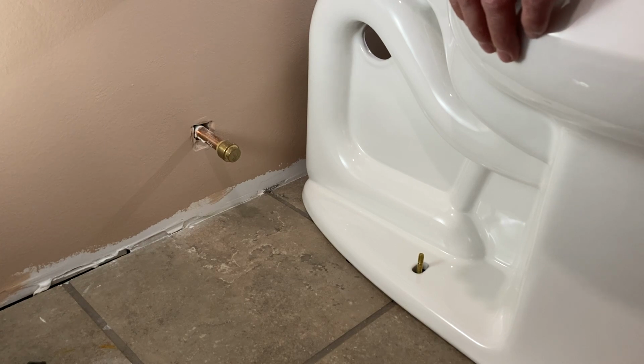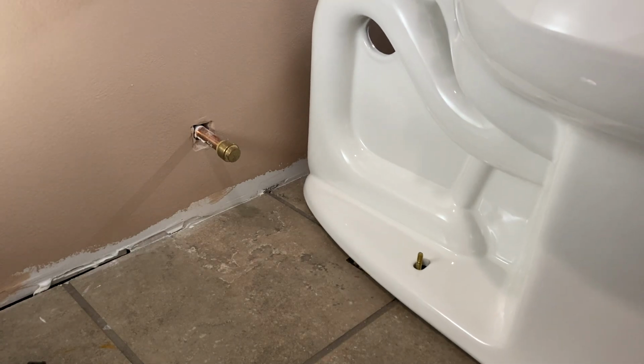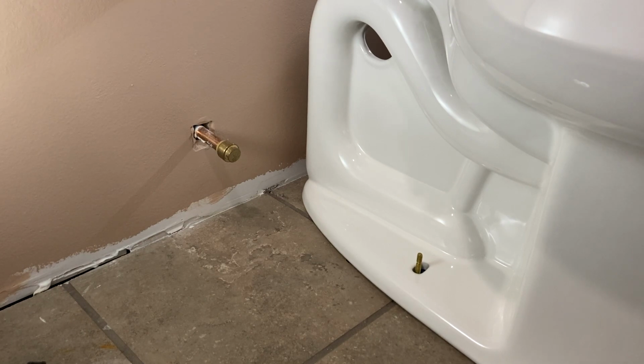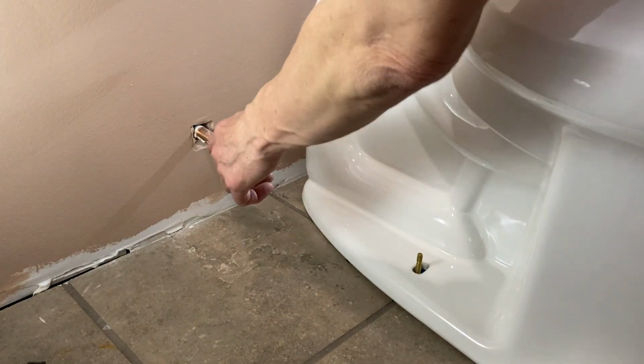But for it to be so flush that it doesn't push anything down, that's bothersome too, because you want to make sure there's enough pressure to make a complete seal all the way around. Well, that's sealed in, because the blue is wanting to come up with the toilet now. So it's sealed into the toilet and it goes down into the flange. We have to address this.